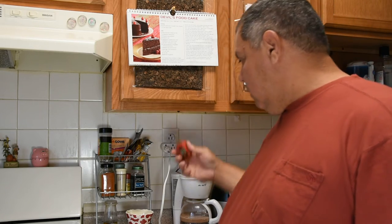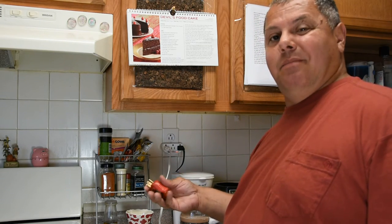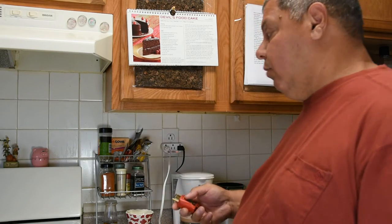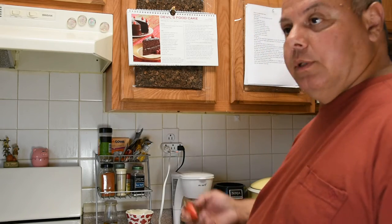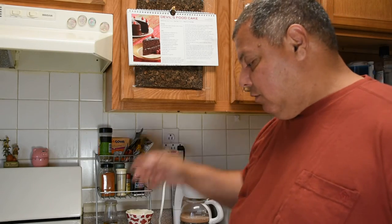This tester is about ten bucks — we used to get them for five or six dollars. Do get the one with the GFCI test button; without it, it'll tell you if the outlet is wired correctly but you won't be able to trip and test the GFCI. That matters because GFCIs should be required within six feet of water. Anywhere near a sink I'd want a GFCI. New construction definitely requires one within a certain distance of water.